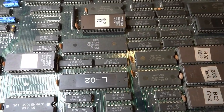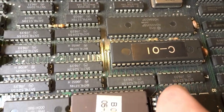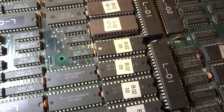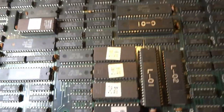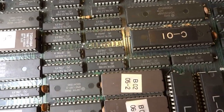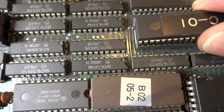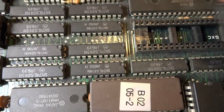These are some tips that Caius has actually said on his site — the biggest ones will be the C01 or the L02s. The difference in boards is there are a couple of different boards that use the same chips but they just have different numbers on them, but underneath they are the same. As an example, this one is like the main ROM here. If this one doesn't work, you'll get just static garbage on screen and you won't be able to start the game.